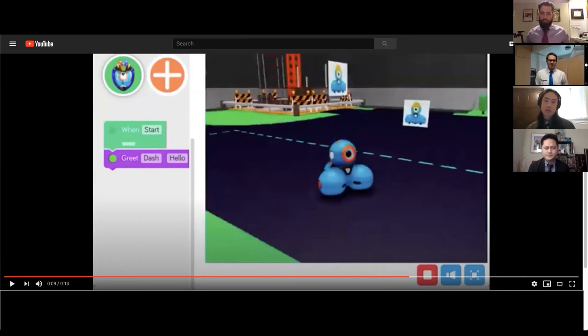So to achieve this desired effect, the head must be able to point to commanded positions, the wheels have to be able to move the body of the robot where we want it, when we want it, et cetera, et cetera. All this requires different levels of controls called control systems to control the various electric motors to make Dash do what we want. On Dash, the control systems we use to control the head and wheels are called PID controllers, which are a type of closed loop control system.